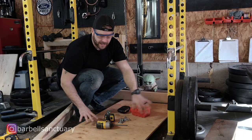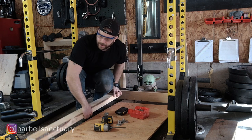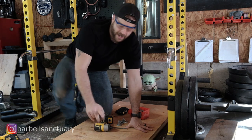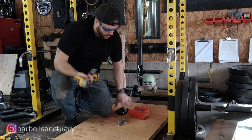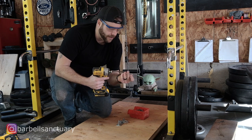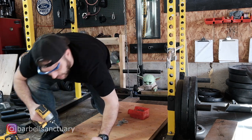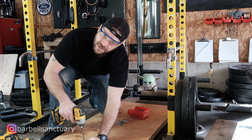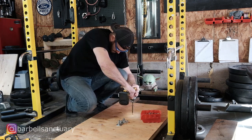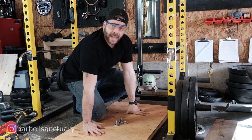So now this is firmly in place, but it rocks back and forth. So I'm going to take my other pieces of 2x4 that I was originally going to use and just put them on the edges. Now I'm going to end up with a nice platform like I wanted originally — it's just going to be a bit higher, which is fine, but it's going to be a lot more safe. A couple screws. Now the middle one is already kind of secured, but I don't want it moving around under there, so I'm going to put some screws in there as well. Nice and solid.